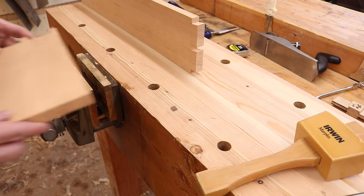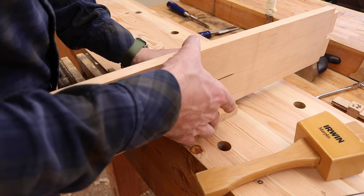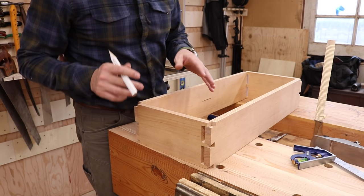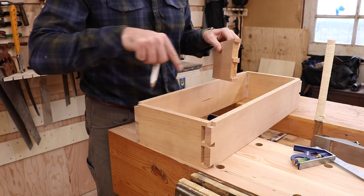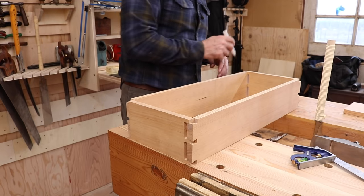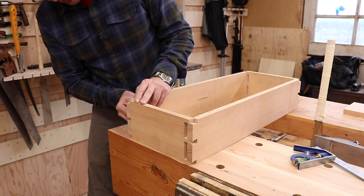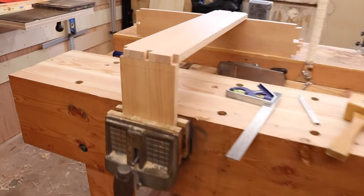Now to the other side. It would have been more efficient to have marked both pieces at the same time. It's absolutely critical that you keep track of all these pieces — I had to cut C and D twice because I mixed them up. So what I do is mark A, B, C, D, E, F, G, H on the top. I also put a light directional line that I can plane out later, so I know which way each piece faces. I can't tell you how critical this is.